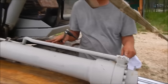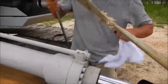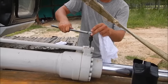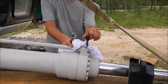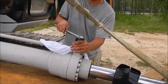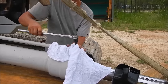I don't have to take these steel lines to the hydraulic shop to get repaired because they're liable to roll around and get bent or broke. So I'm taking these off, and this is usually when it gets interesting — the machine was running and these have pressure on them, and there's no pressure relief that I know of on this thing. It can tend to spray, usually when I take this last bolt out. Why are you backing up, Zach? It's got about 5,000 psi pressure — that's what this thing runs. I have been drenched before, so we're going to do this safely here, somewhat.